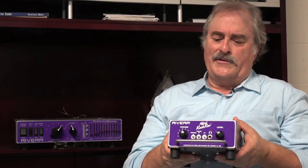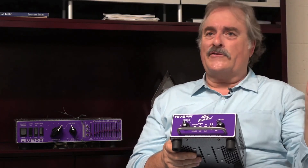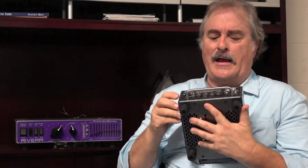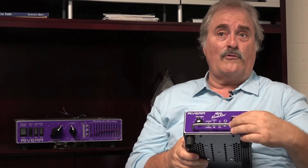This box is a great load box, but it also functions as a terrific headphone interface. For those late nights when you want no-latency headphone listening with immediate response, plug your phones in here and turn off your speaker cabinet. We have a bypass for the cabinet — a choice of load or speaker. Turn it to load, plug in the phones, and enjoy yourself in complete silence. There's a level control that affects the direct out unbalanced output as well as the balanced output, but it does not affect the headphone or the unequalized jack for cab modeling software.